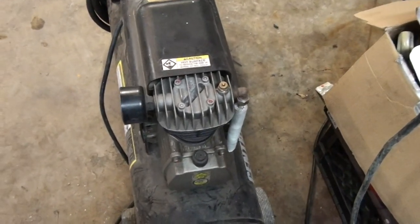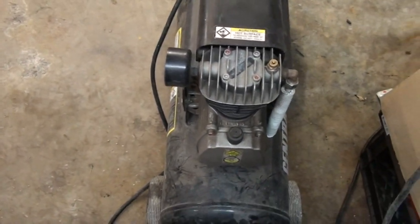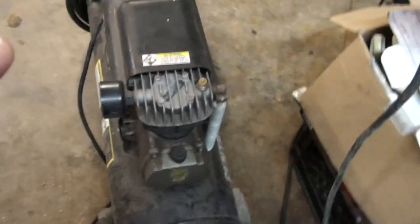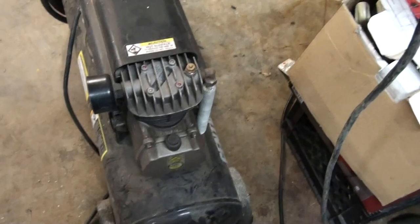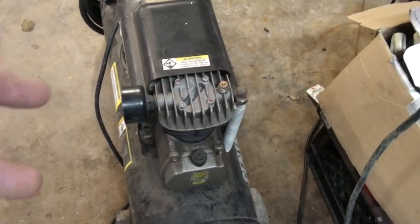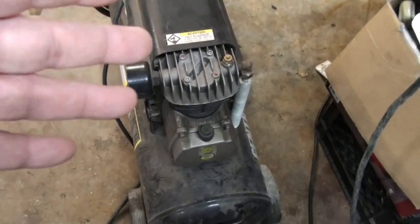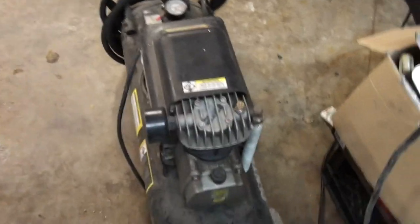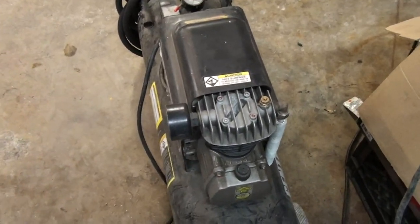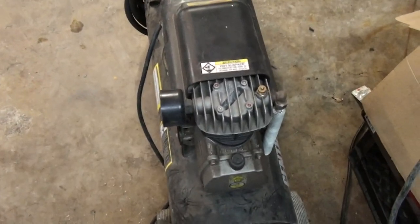The other part is this garage — it has horrible electrical service out here. This is a 2.5 horsepower motor, and as a result it wants a lot of juice just to kick on. Once it kicks on and starts running, it's fine. The problem is it's not getting enough juice, so even when it's warm it doesn't always kick on. If I bring it in the house, which I've done a couple of times, and let it get up to room temperature, it functions perfectly normal.